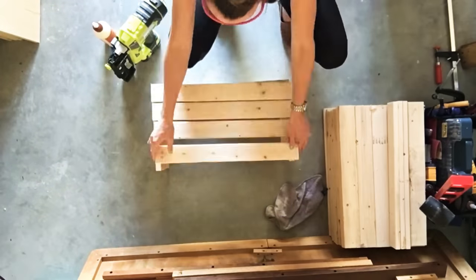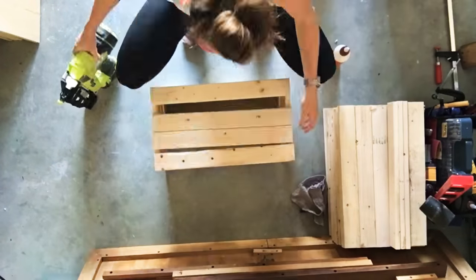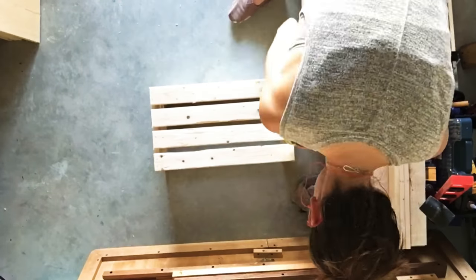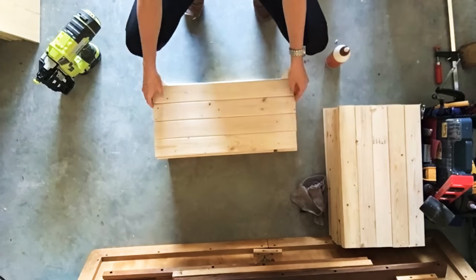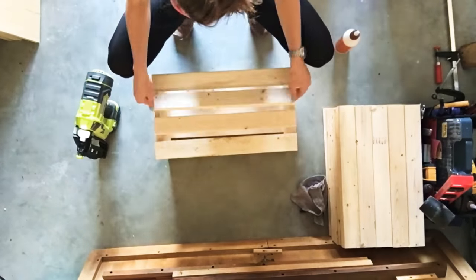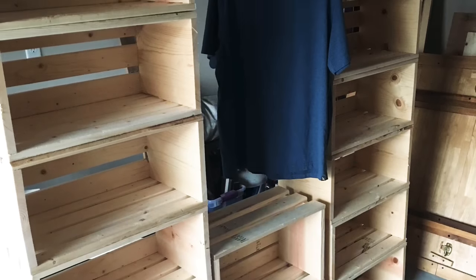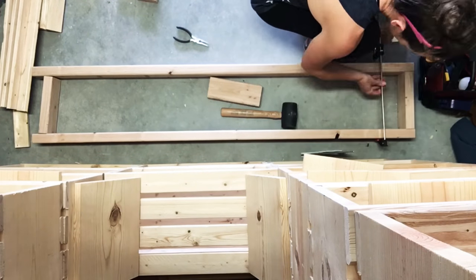In a nutshell, these are made out of two pieces — ends and slats. My ends are made out of 1x10s cut to length, and my slats are 1x3s cut to length as well. For me, that looks like about 21 inches for this custom piece of furniture. And I'm just attaching my slats to the end pieces using wood glue and 1-1/4-inch nails and my nailer.